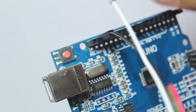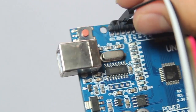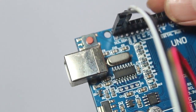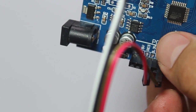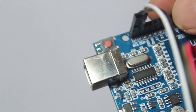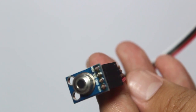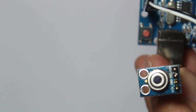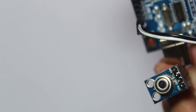After the power connections, connect the SCL of the sensor to the SCL of the Arduino, and SDA to the SDA. The black wire goes to SCL and the white wire to SDA. Let's verify: VIN, ground, SCL, SDA — it's all connected to the Arduino.